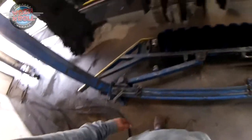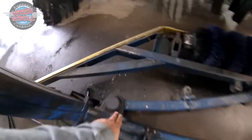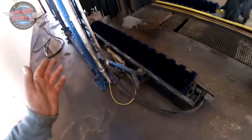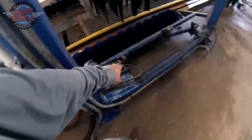These are our tire brushes, which are going to have 10 grease bearings on them. The first one is right here, then there are two on each section of arm — one, two on the bottom, one two, one two, one two — and the final one on the end. That is 10 on each brush. It doesn't matter what type of brush it is; it's always going to have 10 grease bearings.